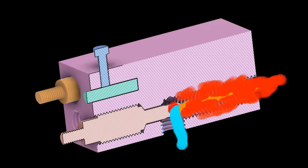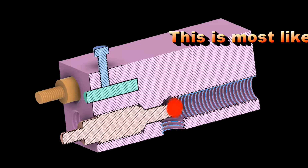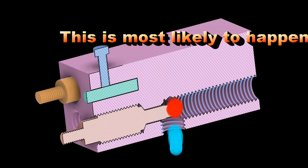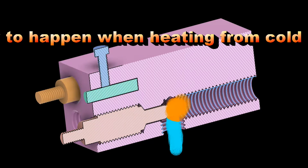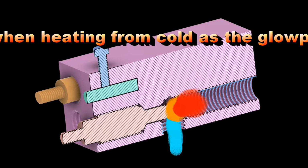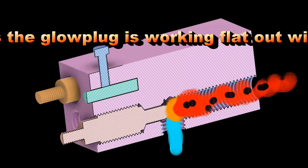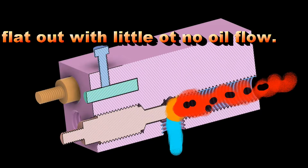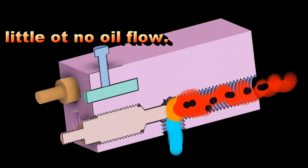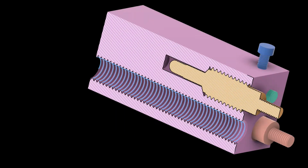Now, my concern was that the oil might carbonise around the tip of the glow plug. I mean, this thing glows red hot. So I was worried that the oil lingering around the tip of the glow plug might end up producing carbon particles as it effectively boils, and of course, that ends up getting into the burner and effectively blocking it up, which really wouldn't be very helpful. So this was in the back of my mind all the way through the build, and that's why I built it with two options. I didn't go for this option entirely in the end at all. I never used it and went for this option.